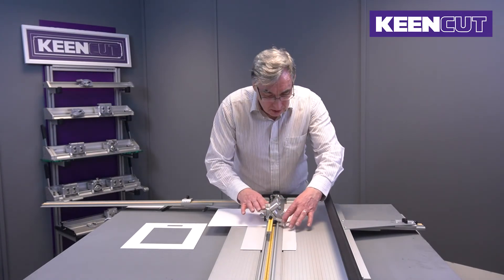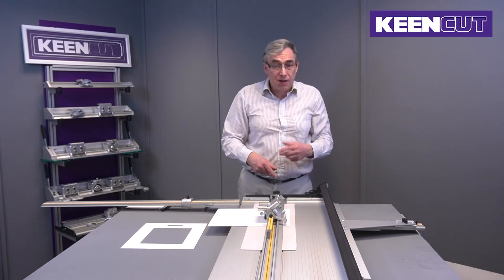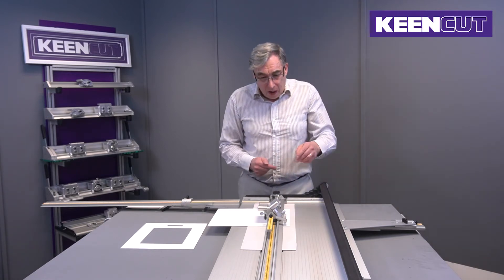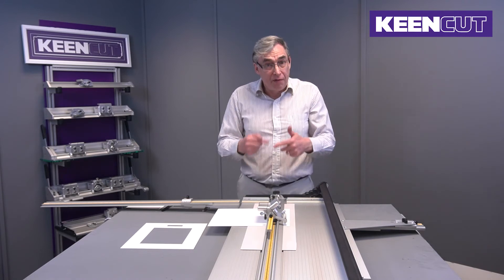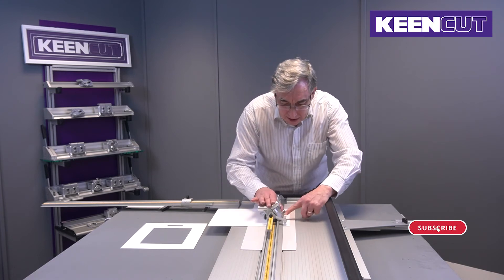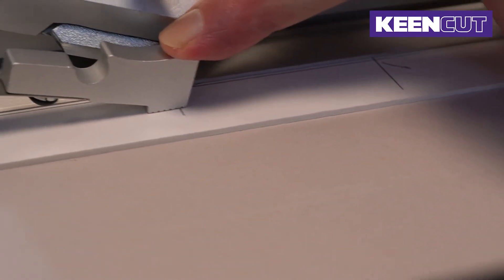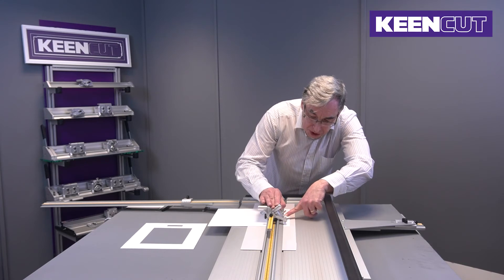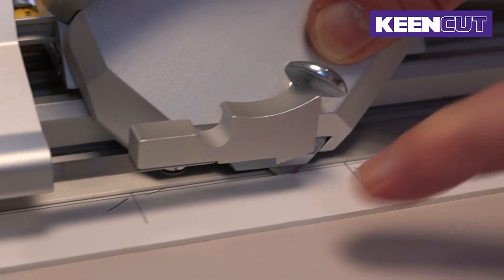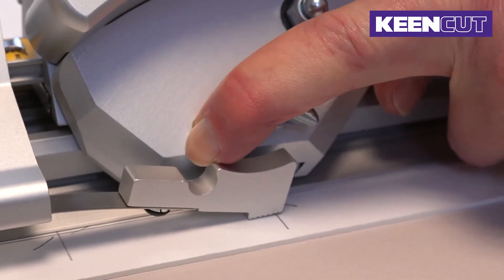When you're cutting without using the stops you can use the finger gauge. When I was doing some test cuts — and it's well worth doing a little bit of practice — I found it was slightly over cutting on the start of the cut and slightly under cutting on the finish. So using the finger gauge, because it's over cutting, I'm going to come about two millimeters past the line. Push the blade in, and because it was under cutting I'm going to take the gauge about two millimeters past.